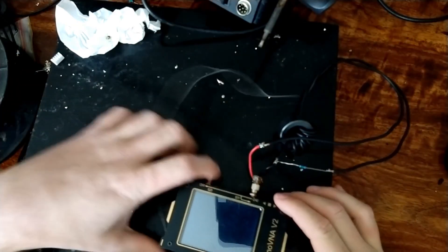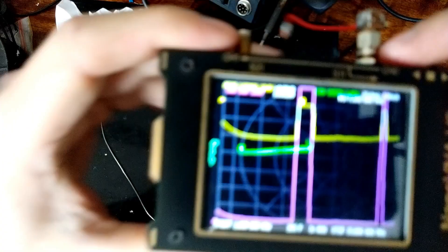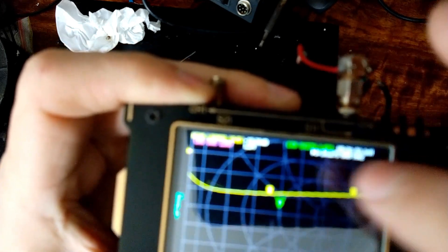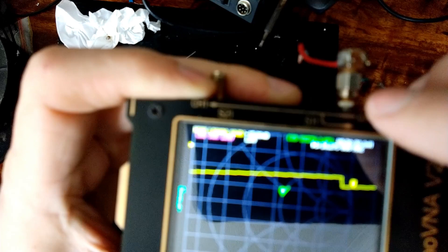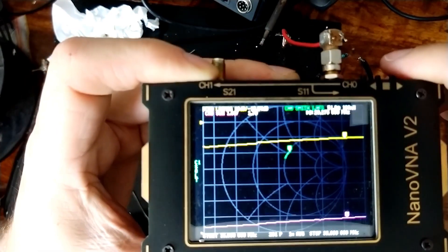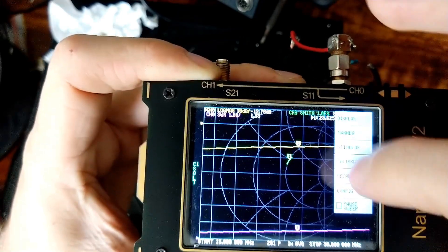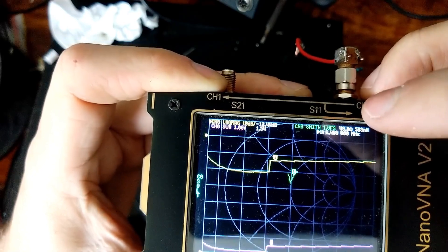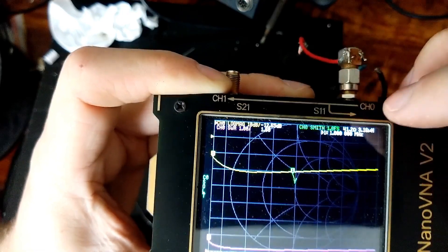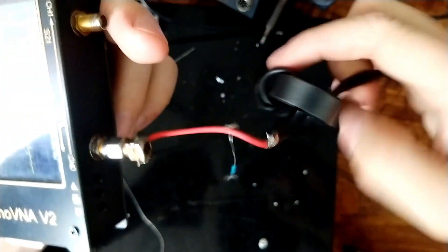Let's have another go. I've got a bad connection somewhere. Recall one. That actually didn't make much of a difference - I took out one winding. Yeah, 1.7 to 1. And obviously it just gets better as you go lower until a certain point, then the transformer stops having enough inductance and it tapers off at the low end.